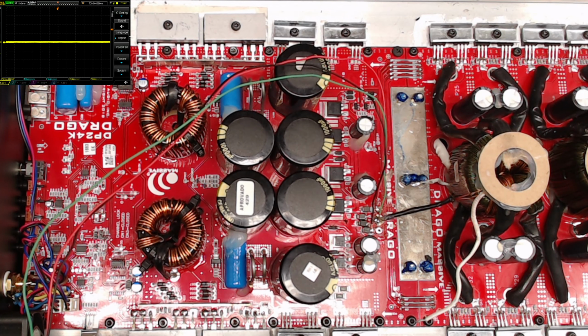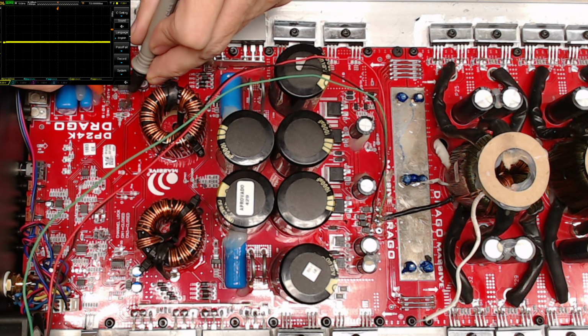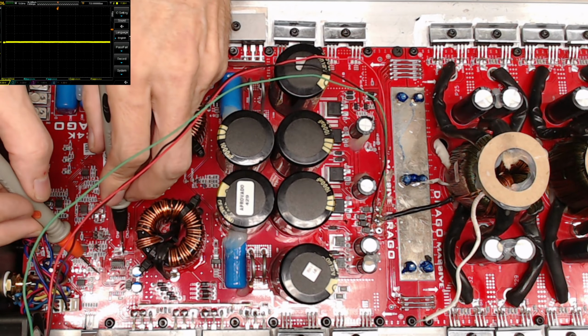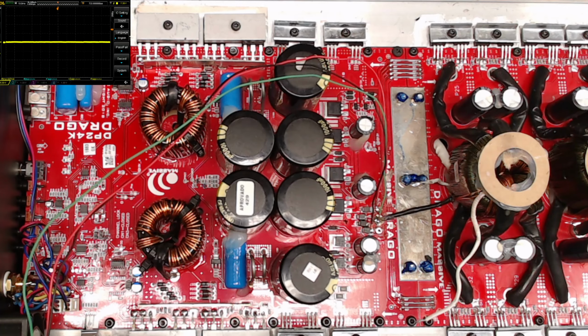And I just have no known reason why these are doing what they're doing, unless there's a Zener. No, I see, it looks like a 4148 diode. Let's see here. Which is connected to ground, but is not related to the auxiliary power. 4.5K, it kind of is. Let's see here. Yeah, 4.7K. All right. Well, let's fire it up, see what it does.